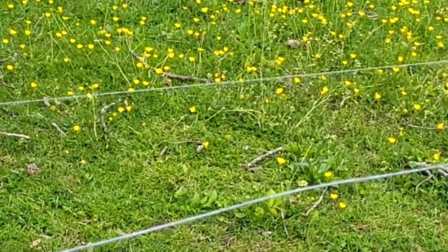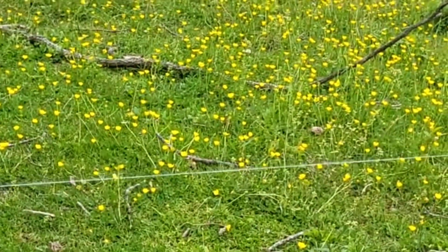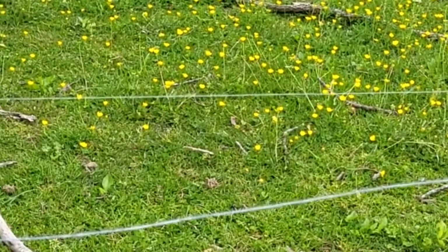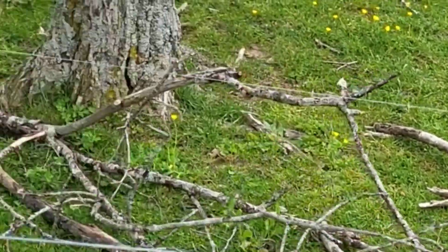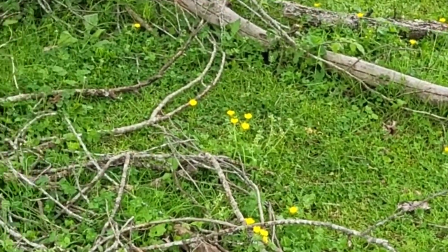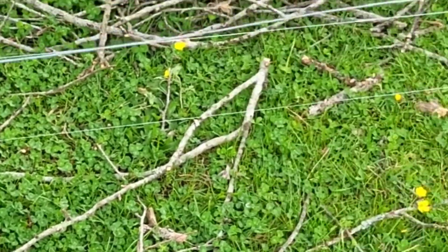And like I said, looking at it, it does kind of mess with your mind because it gives you a 3D effect. You know there's lines there, but you just really don't know how many. Stop and count them. I know there's 4 on the outside and 1 on the inside. So, deterrence. Hopefully that deer that decides to crawl under get spooked away. That electric fence, that's a great deterrent. I'll add another strand to that. I'll drop it down about 8 inches up off the ground and run it right around through the other same way.